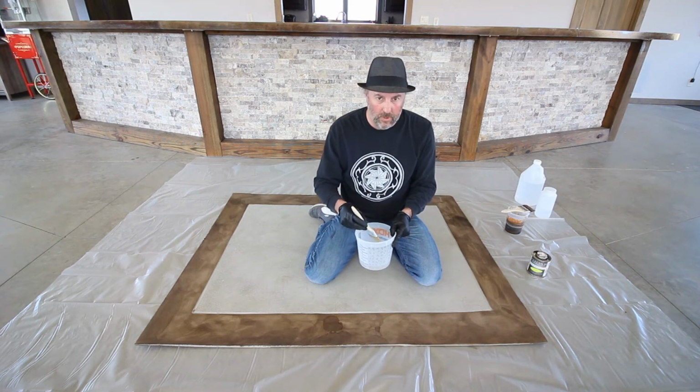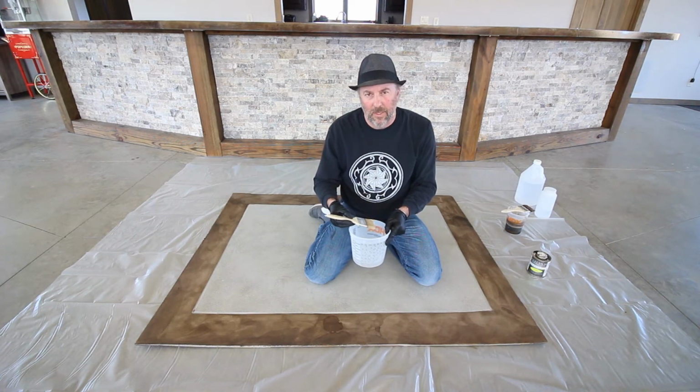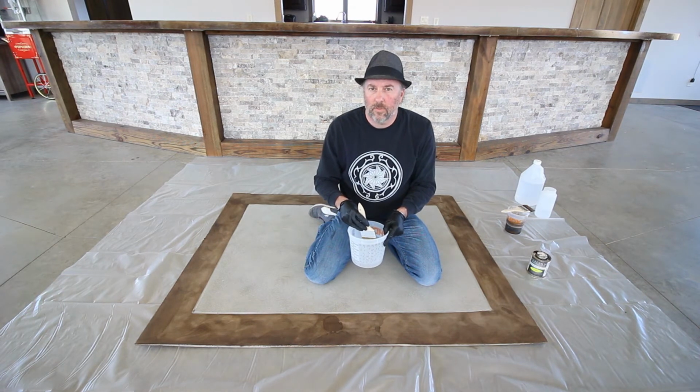So you want to remember, when you follow with the denatured, you're kind of going to make a puddle, just a little bit of a puddle. You don't want to make a big puddle that's going to flood your whole floor, but you kind of want to make a puddle, move the puddle, and leave it alone. You might see a couple brush marks inside of the puddle, but if you watch, they'll disappear as it kind of lays out before it starts to dry.